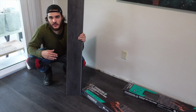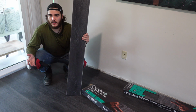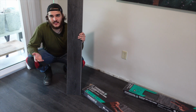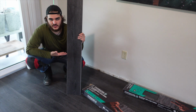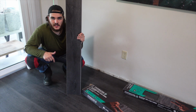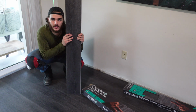The problem is that when you purchase the cheaper vinyl, you also have to go and purchase a roll of underlayment separate and install that prior to installing your vinyl, meaning that the prep work for the installation is going to be a little bit lengthier than if you just spend a few more bucks and purchase a board like this one. We are using the waterproof vinyl plank flooring in the color Obsidian Brown Oak, which we will make sure to link below. And as you have seen, this has made the installation process a lot simpler.